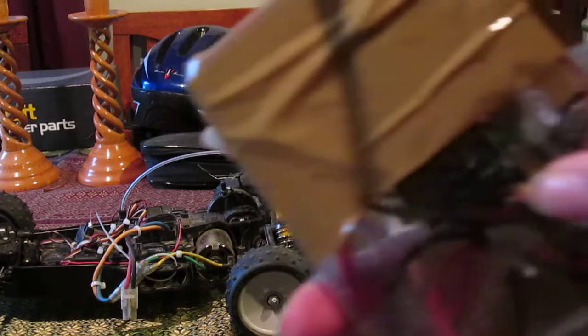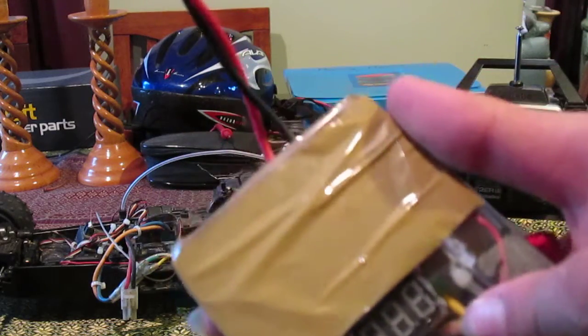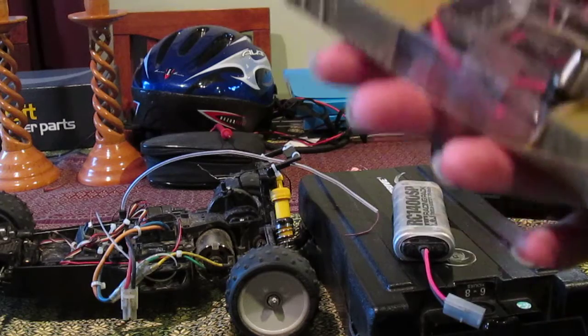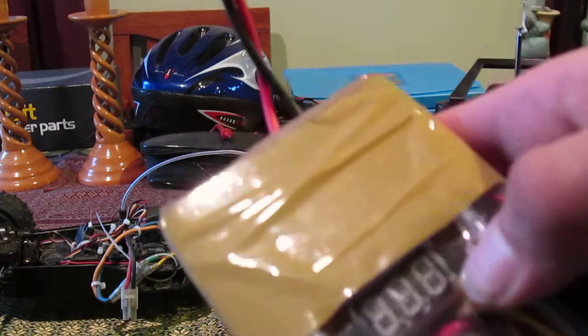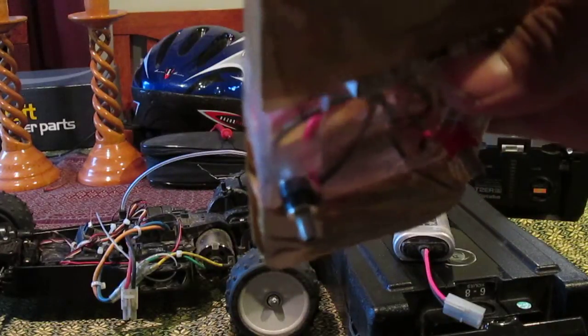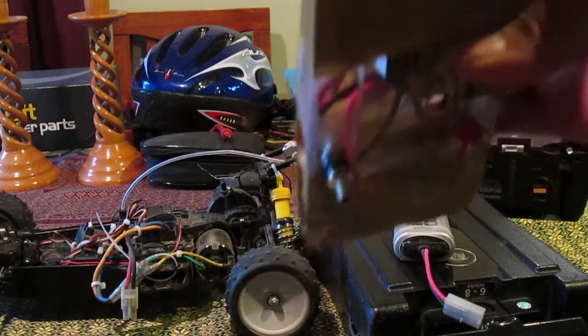There's an LED voltmeter. It really only has to do between about 6 volts and 10 volts, because that's the maximum it's going to be doing. I think this one does like 2.5 to 30 volts. And you might not be able to see down in there, but it's a 12 volt to 9 volt step-down converter.